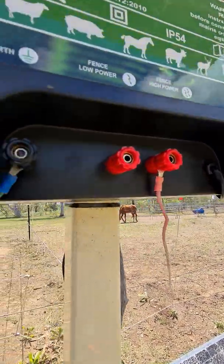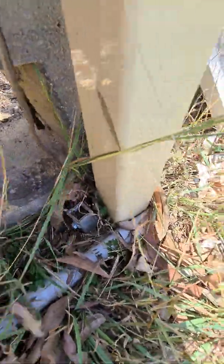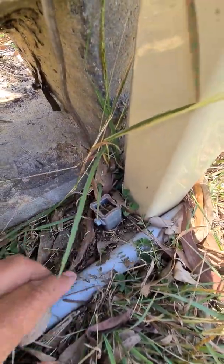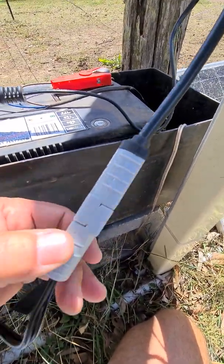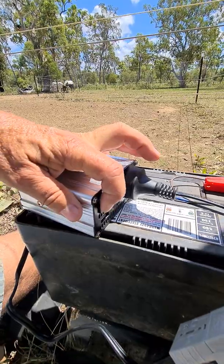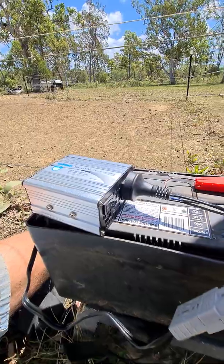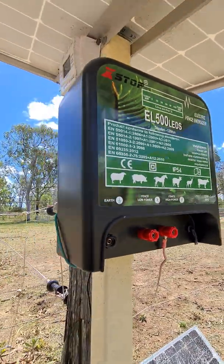And this is just my ground — it runs straight into the stake that I've driven into the ground with a wire on it, which is about half a meter deep. And just two Anderson plugs — if I need to disconnect it, I can just pull the plugs apart. That's my whole system. I'll turn it back on — there, she's starting to click away. 240 volt system. Thanks for watching, cheers!